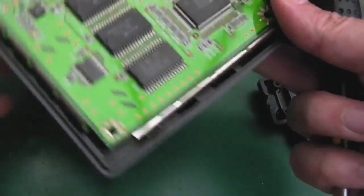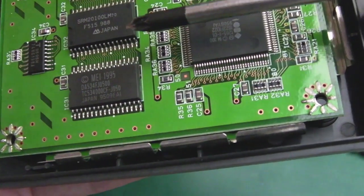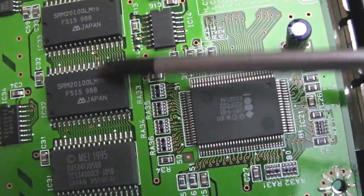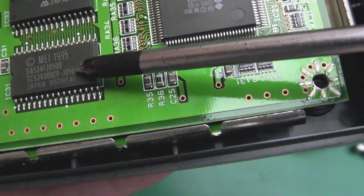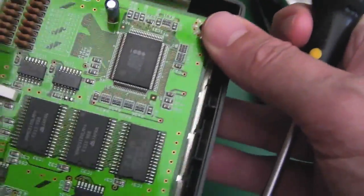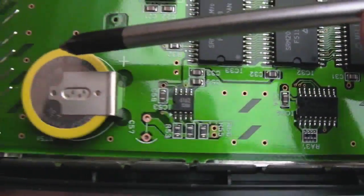So yeah, and it's like I suspected, some larger chips here. I think we've got, looks like 3. One of these could be a ROM actually. I suspect those two are SRAMs, perhaps 128k each, and I think that could be a ROM, perhaps used by this IC here. So yeah, it's not the sort of thing you could easily replicate. It's not like there's just some SRAM at the end of the connections here. So ultimately that battery's going to need swapping out.